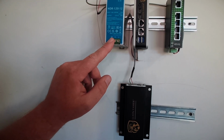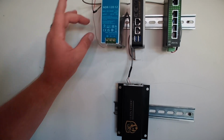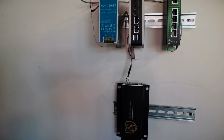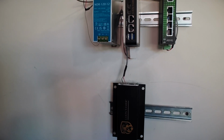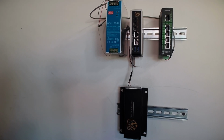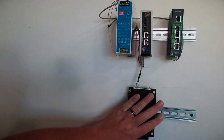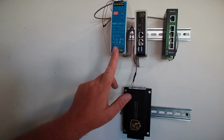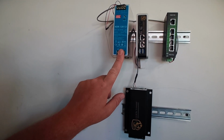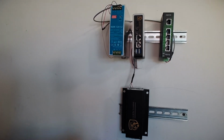Now, my recommendation always is to put a bus bar in and do a proper ground terminal, rather than a wire nut with a single cable over here. Electrically, I guess it's fine, but it is not good craftsmanship. So here we go. We've got all the stuff ready for voltage. As you can see, I do not have the 120 plugged up and ready to go yet. We're not quite ready to get there.